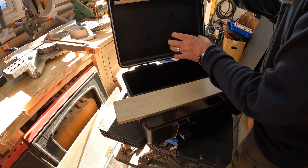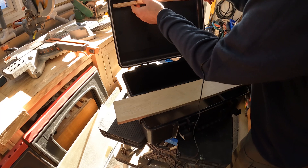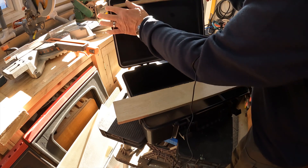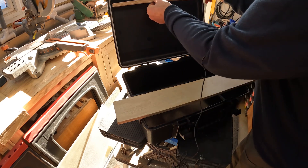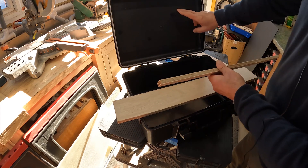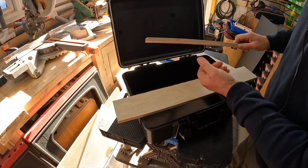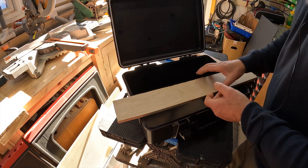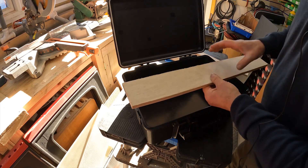The thinner piece goes in the lid with plastic over the top. Make sure it's not too deep — it shouldn't stick out further than the lid. Measure the distance between the top and the front and take away a little bit to allow for the plastic. This is all going to be glued in. You can't screw into the lid since you don't want screws showing on the other side, so use plenty of strong glue like 'Hard as Nails'.